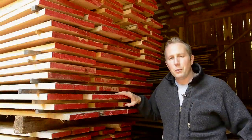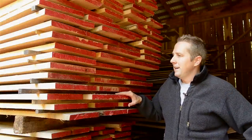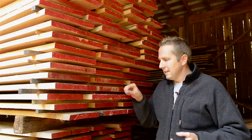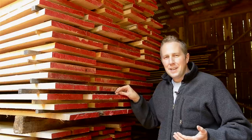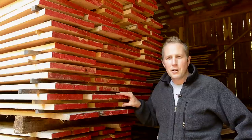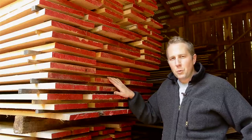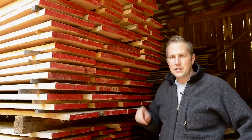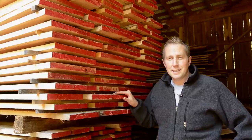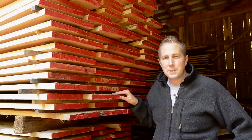The first thing I like to consider when buying wood for a project is hardwood or softwood. Wood hardness is determined by the Janka test — they put a little steel ball in wood, compress it, and see how much pressure it takes to go down into the wood. Wood like white oak is quite a bit harder than soft pine. On the accompanying blog post, I'll share a list showing the different hardness of different types of lumber.